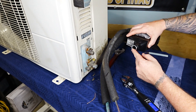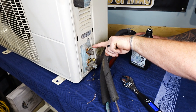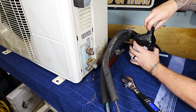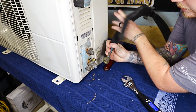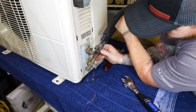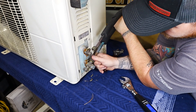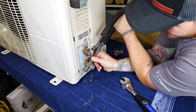One little trick before you get started: take either nylog or a little bit of vacuum pump oil and put it right there on the rim where the flare is going to sit. That'll give it just a little bit of extra seal. Take your lines — the mover should already have that part taken care of — but I'm going to take my flare and sit it right on there as perfect as I can. I'm going to hand-tighten the nut while holding pressure off that flare; I just want to keep it straight. Hand tight.